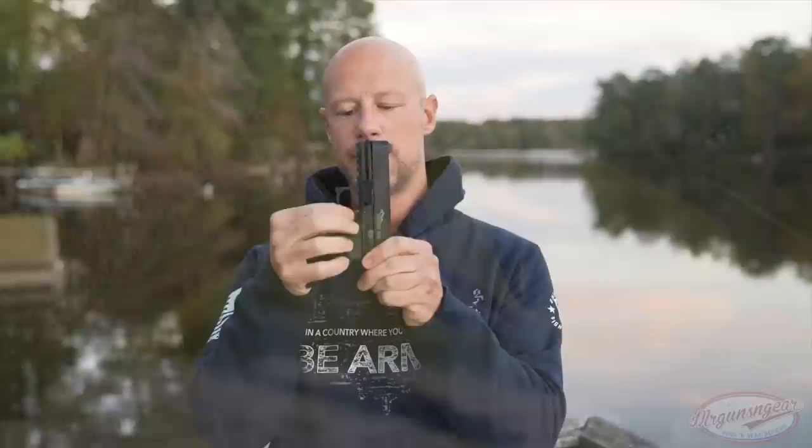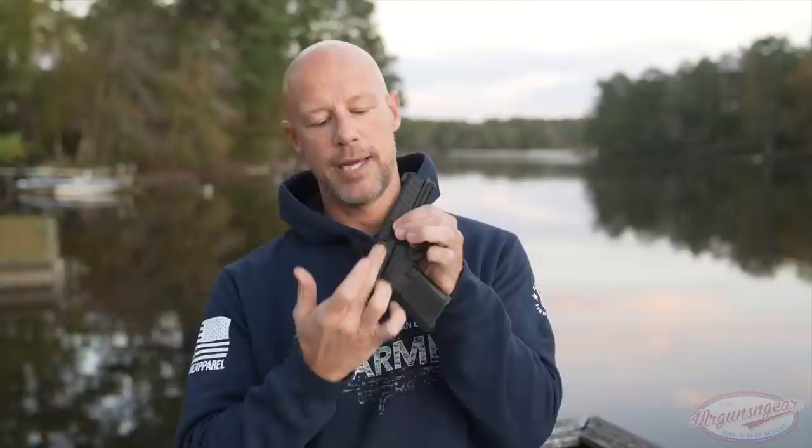And reassemble, basically exactly like your standard Glock. Nothing too fancy there in that regard. The trigger there has our trigger safety, which is this portion here. If you don't press that, if you just press outside, the trigger itself, of course, will not go off. We already talked about the striker safety inside there. Additionally, it does have the loaded chamber indicator, just like your traditional Glock would. So if you have a round in the chamber, your extractor will be pushing out and giving you a tactile and visual notification that the pistol is loaded. But of course, it is not loaded.